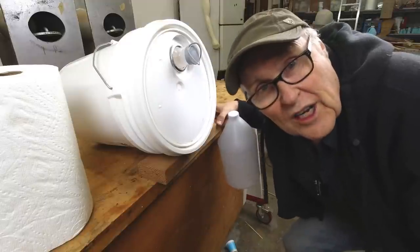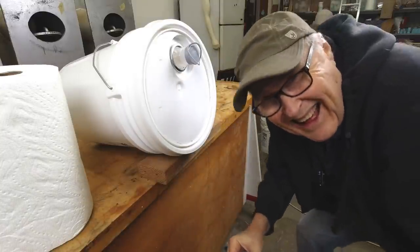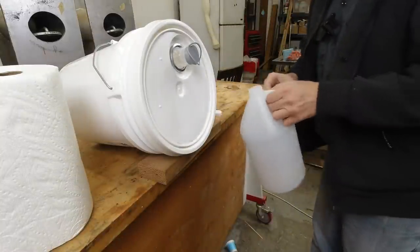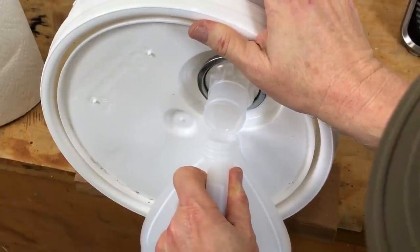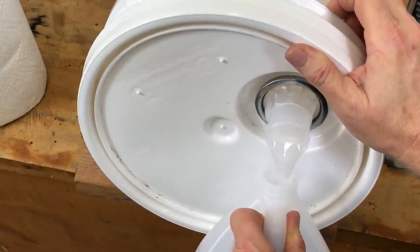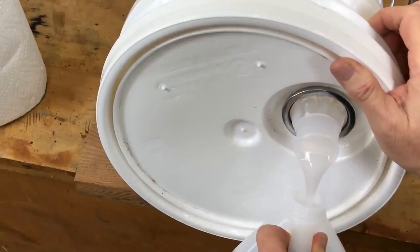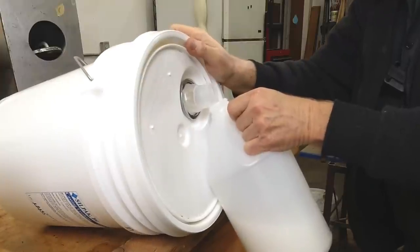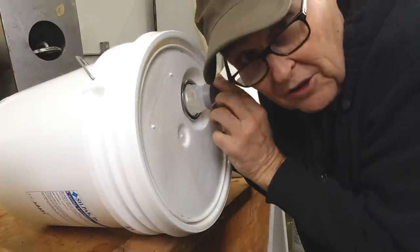Let's go ahead and fill this jug up — three and three quarter pounds. Got a scale, got paper towel in case I have a disaster. This could go horribly wrong or I'll do it perfectly and look like a pro. Okay, here we go. I am dispensing. See how gentle that is, how easy that is. Now I don't want to dispense too much or I'll have to pour it back. By rolling the bucket you're lowering the nozzle and therefore more stuff comes out — that's how you control it. Wipe so I don't have drips, and secure the bucket so I don't have a disaster.